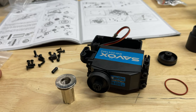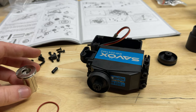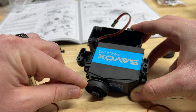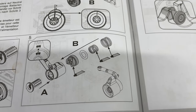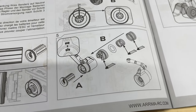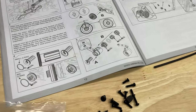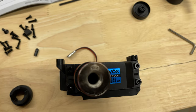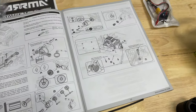It's calling for a little bit of grease on the small and large O-rings. The small one goes right around this ring here, the large one goes right around this ring. And it looks like it's asking for some grease around both the springs and that retaining clip. We'll get all that taken care of. You can see the alignment there of that piece — I'll show you guys what it looks like when it's done.